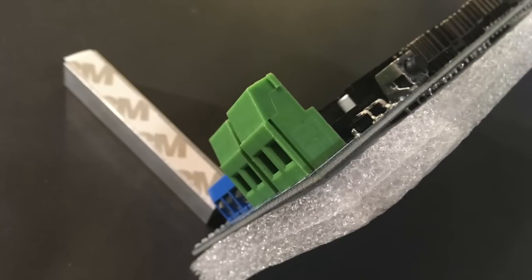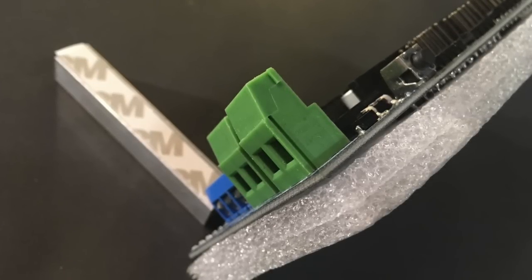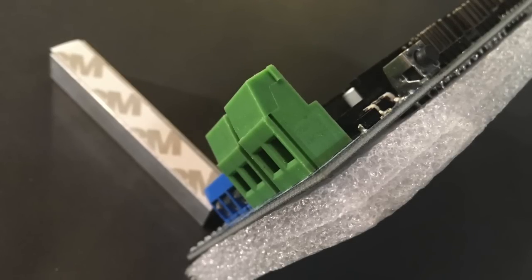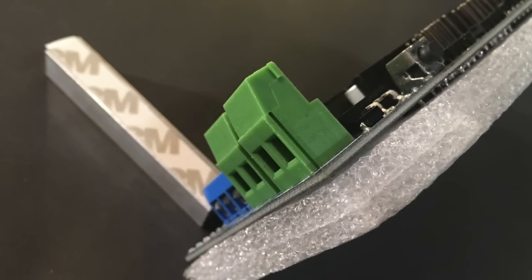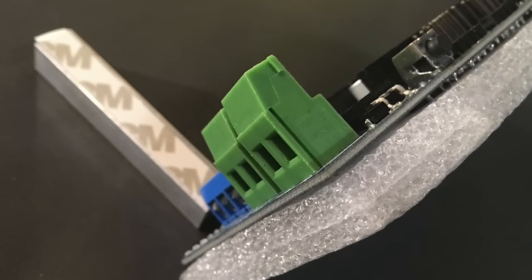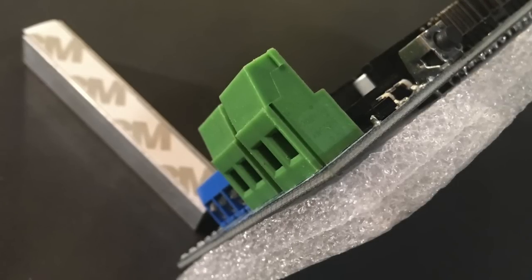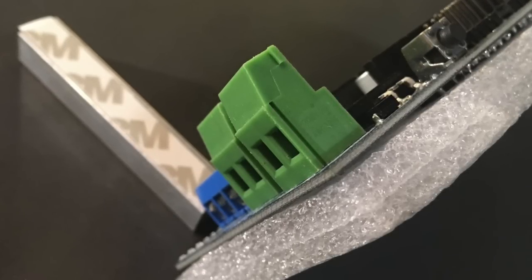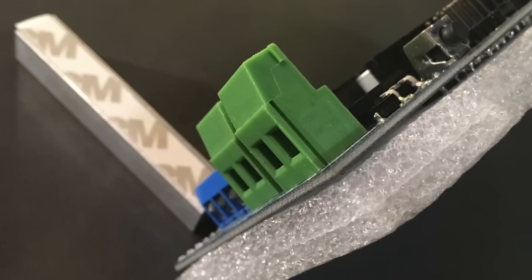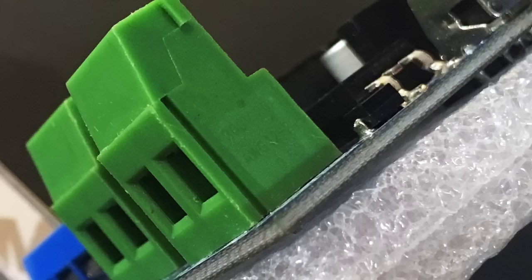You still have to take care when wiring up your power supply that you don't have frayed cables, that you use the proper gauge, and preferably use ferrules. Remember not to tin your wire tips before you put them into this style of clamp. Because of the rising spring clamp system, you will have problems with cold creep, you will increase contact resistance, and you will melt your connector. But as far as the connectors themselves, these claim to be rated at 300 volts, 20 amps, so it should be sufficient.